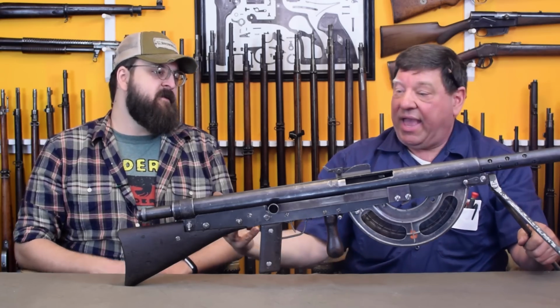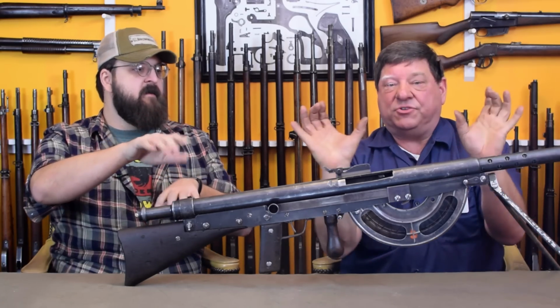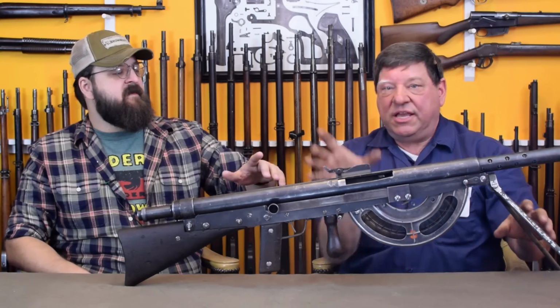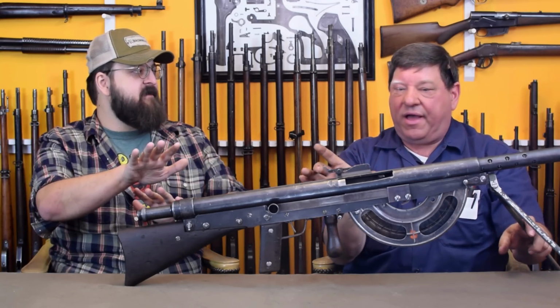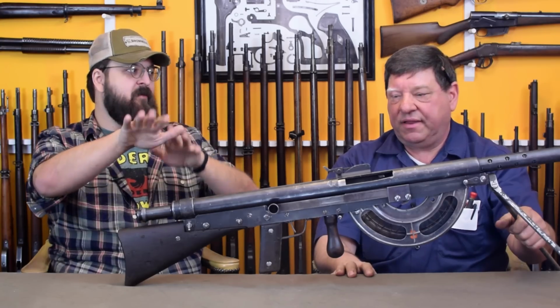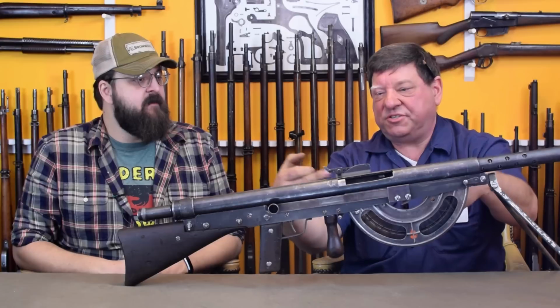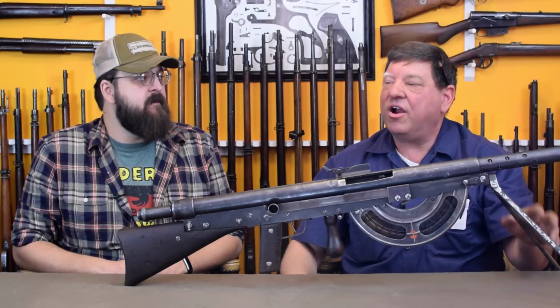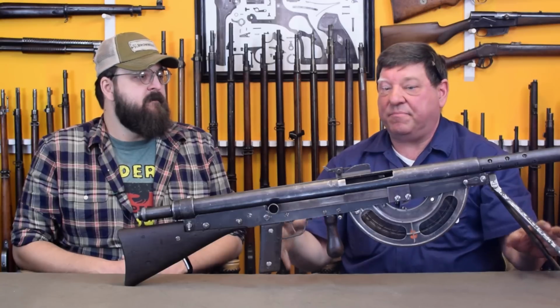No, it's two axes of rotation, right? Right. There's 2 eccentrics in there. If you loosen both of them, the statistics on trying to get it back to correct just by guessing is insane because you now have to pick 2 points. Well, I found that it's better to actually just pick it on the amount of pressure that's on the feed block and then it drops out of the way. It's very hard to describe how I set it up, but I've got it figured.